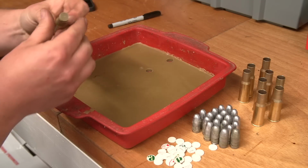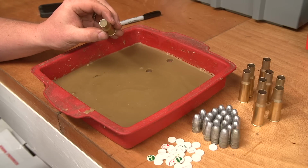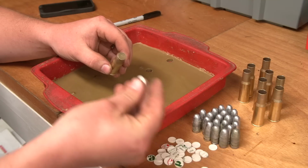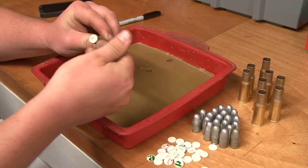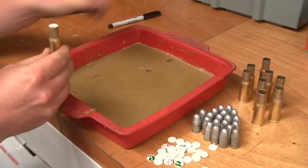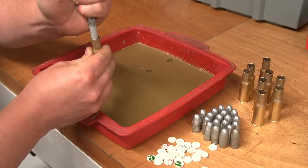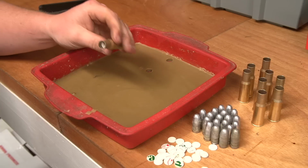All right. That plug of wax is a little over 1/8 of an inch thick, which is exactly what we want. So again, we're going to take our other cardboard disc, push it on top, and that's replicating the original military loading quite nicely. And then we're going to push it home with just an ink pen here. And that's going to smush down real nice.